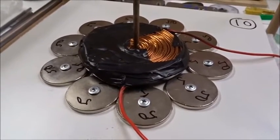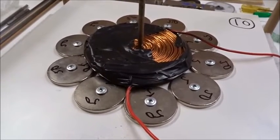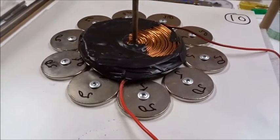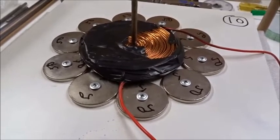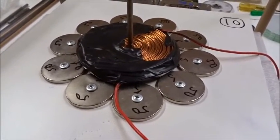We can either levitate up or down on the same field depending on how we design the geometry — forward or reverse field levitation. This pancake coil has about a thousand turns of 1.2mm wire, with 15 volts applied at about 20 amps.